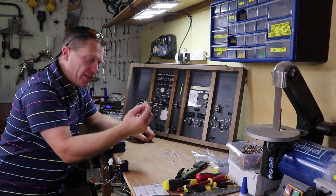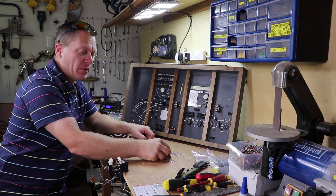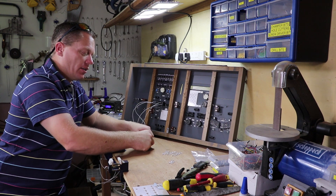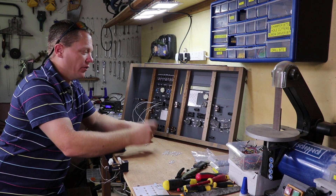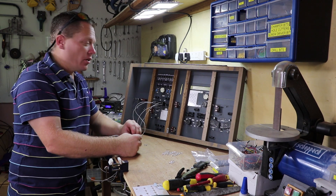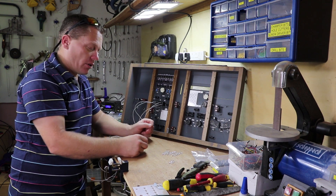That's all the LED pairs created. This little pile here is the orange or amber. We've got three green for the landing lights and two white for the Align on the IRS. So now just got to insert them into the annunciator boxes and use a bit of hot glue to secure them.